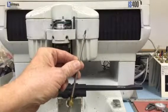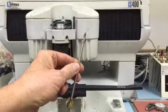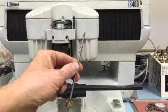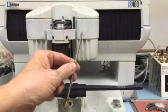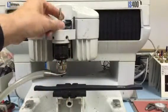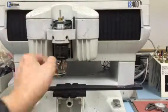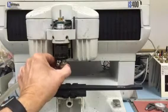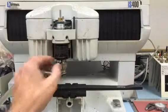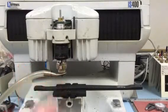This tool is a single flute carbide conical end mill. It has a 30 degree side angle and a 25 thousandths tip on the bottom of the tool. When we put this in the machine, we have a micrometer dial at the bottom which we have adjusted so that when it is on zero, the tip of the tool is just barely flush with the bottom of the nose.